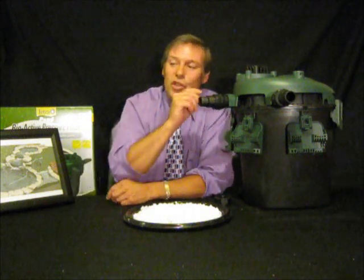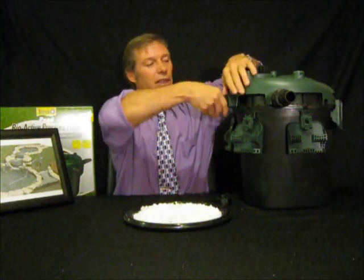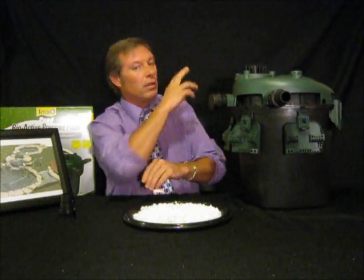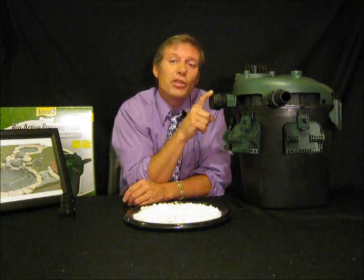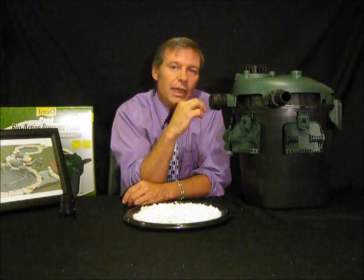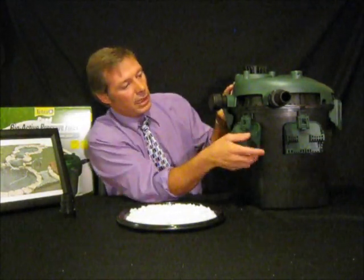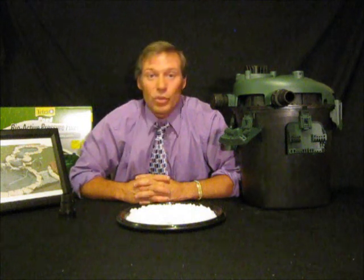As soon as you start seeing the water coming clean, come over here and push it back to 'pond.' While it's running and your waterfall is going, just take the hose off and put your dead cap on. Your pond's clean. But there's another thing — when you're cleaning your system, you're taking water out of the pond too. Make sure you grab some dechlorinator, get it in the pond, and add some fresh water to get it back up to where you need. Make sure all these fittings are on before you do it. Thank you for checking us out, and we'll see you next week.